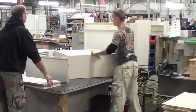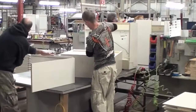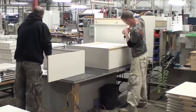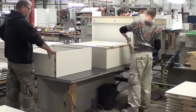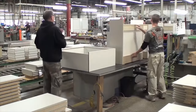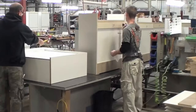The finisher task is to first position the cabinet on the work table in order to secure two support pieces on the back of the cabinet using a nail gun. Next, the employee drills three holes into the bottom support piece and drives three screws into the holes. Then two feet pieces are retrieved and secured on the cabinet with two nails for each piece. The cabinet is then pulled into an upright position and stickers are positioned on the back with the employee's initials before it is pushed onto the roller conveyor.